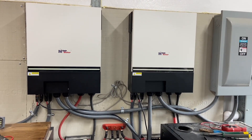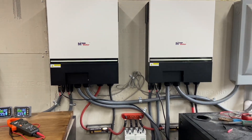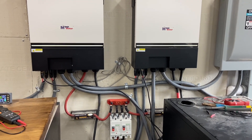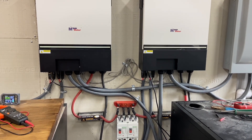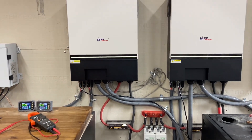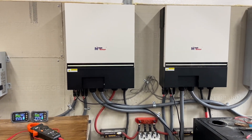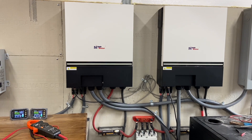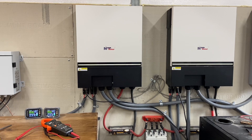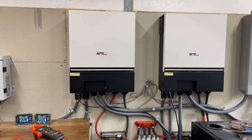I should have taken a longer video, but it looked like a disco hall — the lights were blinking. Some people have had a shimmering effect with them too, where it's just constantly shimmering LED lights. That means there's something wrong with the sine wave. That's what generators with bad total harmonic distortion have. But these actually make the lights strobe up and down, up and down, constantly dimming and then going back up.